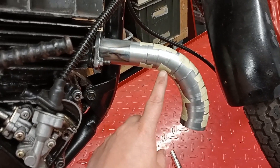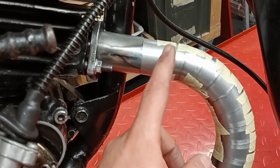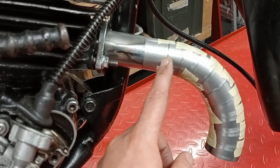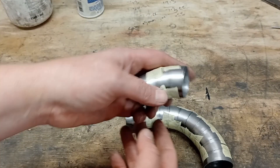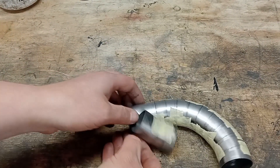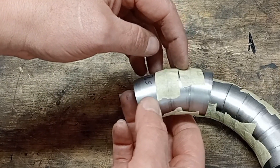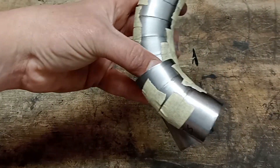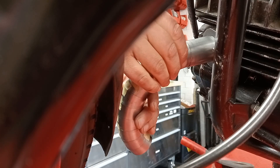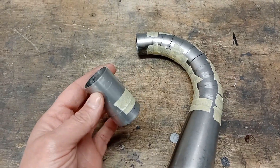Much better now. I've got an angle between these two bits at 15 degrees. What I'm going to do is put a 5-degree angle on each side to give 10 degrees there, and then doing over 10 degrees there — maybe 15 and 15 — just to get this to tuck in a lot more. I've made another front section, put it on there, and I've put a 6-degree cut on each section, so you've got 12 degrees and 12 degrees there, and then as it goes in there it's 12 degrees. So I'm going to get a little bit of extra turn.